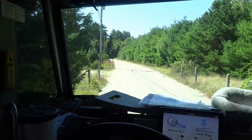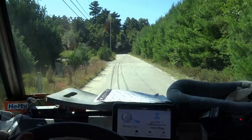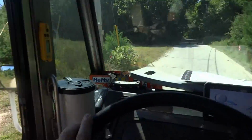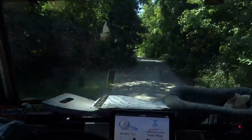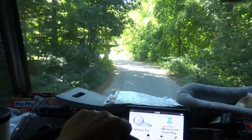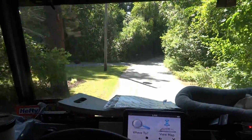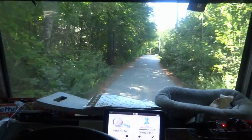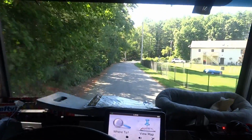But I'm thinking it's more likely that pump than it is that motor. But it definitely was bound up when I got there, because I put my hands in there and I spun it, and she freed up. So I told the lady the situation, she wants to wait. So we wait. Give her a service call bill, and if it happens again, we'll get into it deeper. Well, that's the problem with them outside tanks. You get moisture in them, and moisture in the pump, and I did take the cover off, and I didn't see no water come out, so might have been a freak thing.